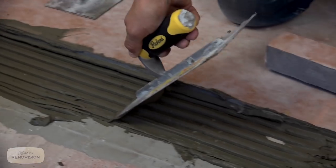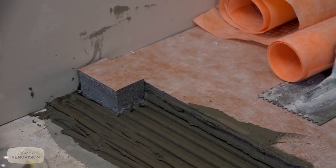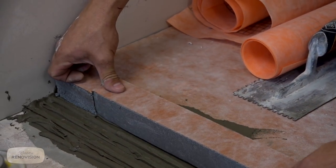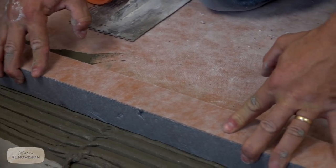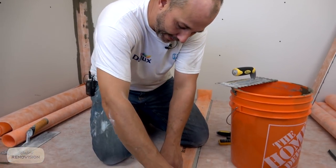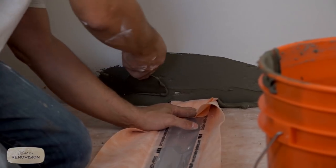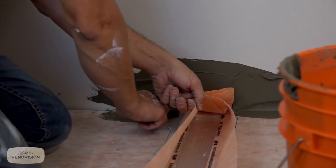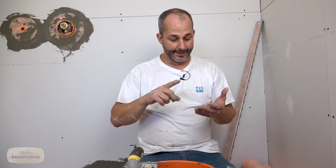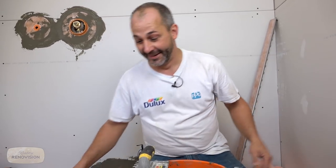The next thing we're going to do is put down our curb. Now my curb is a bit of a cheat — when I bought these shower pans they were extremely large, five feet by five feet each, so I had a lot of excess material. What I did is take a couple inches off the highest part of each of those and I'm going to use that as my curb. This tray has an integrated waterproofing flange that's part of the drain system. They give a 10-year warranty if you install it properly and you don't ever have to think twice about it. That peace of mind — not just for my client but for me — it's worth its weight in gold.